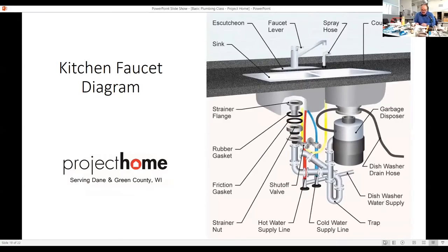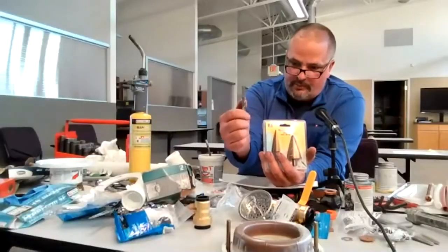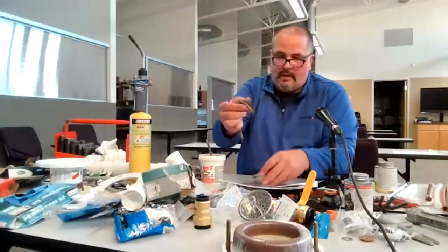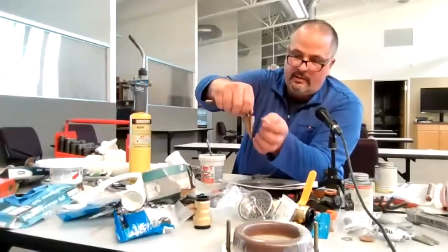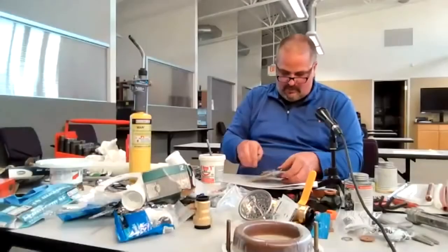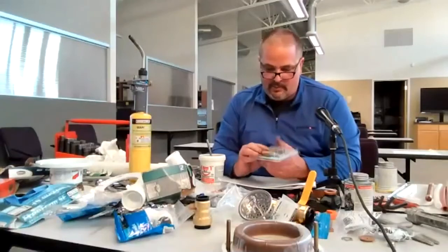The kitchen faucet diagram — I want to touch on something. You have a dishwasher. On the diagram there is no air gap — but you could put an air gap on the left side of the sink. If you have a stainless steel sink, you can use a steel step-drill bit. Get the hole started with a smaller bit, then use the step drill bit in a cordless drill to drill to the right size, and you can add an air gap for your dishwasher in a stainless steel sink. The air gap is per code for a dishwasher.